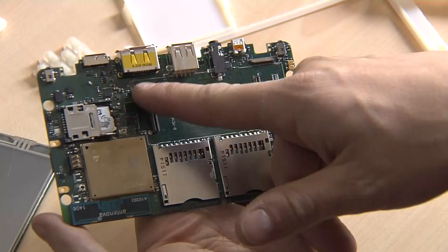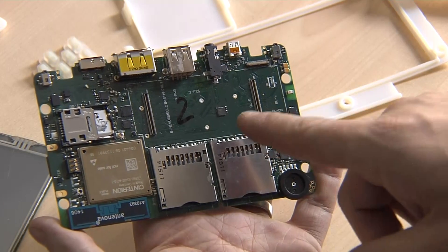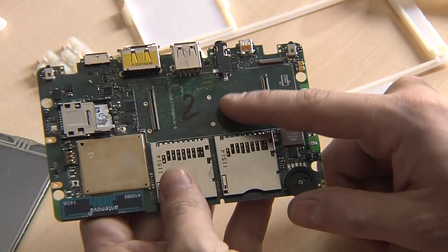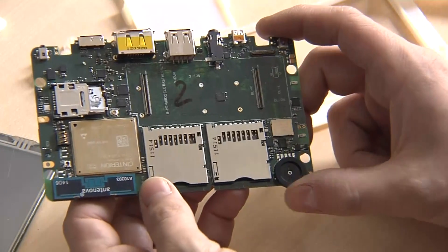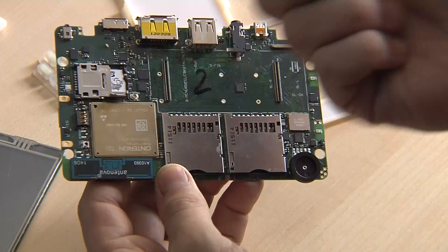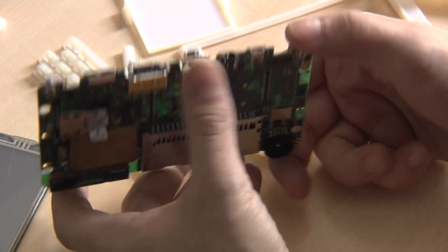On the other side, we've got the space where the CPU PCB plugs in. These two hall sensors are for the knobs — this is only the mechanical part, and this is actually what we'll read out the details from. LTE module, antenna for that, volume wheel, Wi-Fi module, SIM card and microSD card slot, battery contacts. So everything is already on there. Two shoulder buttons on each side.